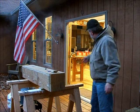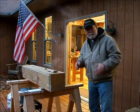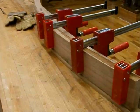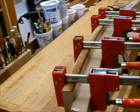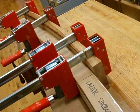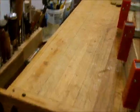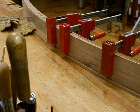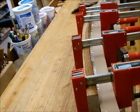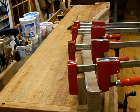It seems as though my piece of solar kiln dried red oak bent around the form. Now clearly this is no serious steam bending, but as an experiment to see if the box works, I'd say it's a success. It seemed to bend around my form with no problem, and that's solar kiln dried. Typically kiln dried doesn't bend as well as air dried, but it seemed to do this shallow radius bend fairly nicely. So I consider the steam box a success.